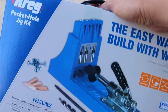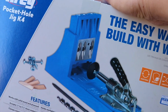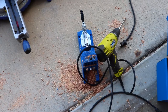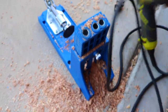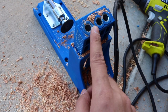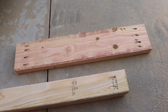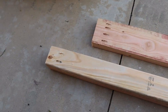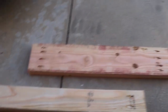So we don't see any screws or anything front-facing when all of the doors are off. I'm making a mess right here — I didn't follow instructions and I just went at it. I messed up and I drilled some holes through my jig. To use this you need to measure your wood piece and adjust the bit, but I didn't adjust this piece here, so I went straight into the jig. But I have my pieces with the pocket holes done — I did four pocket holes on each side for the two-by-sixes and two for the two-by-fours. I got my little jig to line everything up; we're gonna glue and screw everything together to get the frame in place.